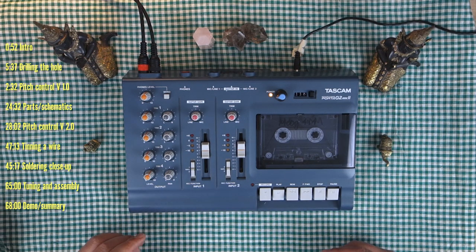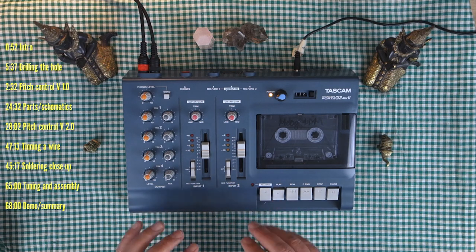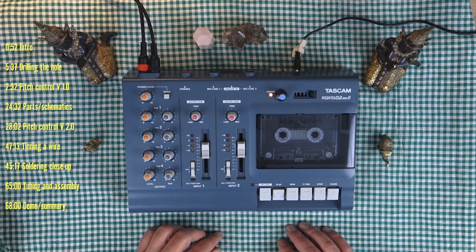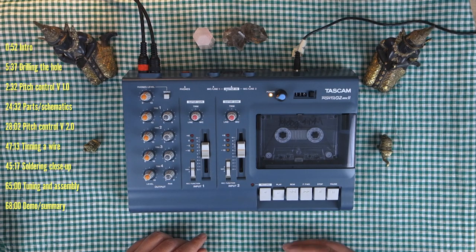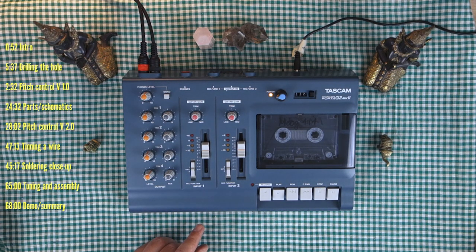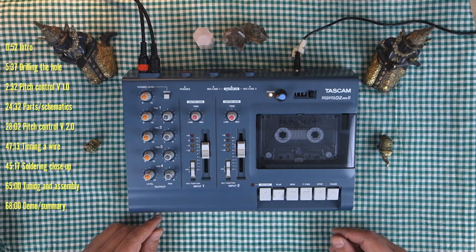It works. In previous videos I've done a jam with stuff like this. I used a Chase Bliss pedal, but any guitar FX pedals would work really well. I was playing guitar with an endless loop tape, using various pedals and a synth — it was really cool. These are great little 4-track recorders you can get for not too expensive and have endless fun with. My last advice: inspect everything really well before you put it back together. Solder can get all over the place and get on the control board — you don't want to short out your investment.